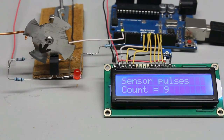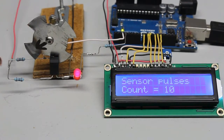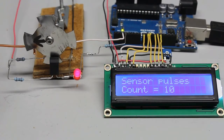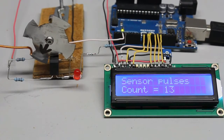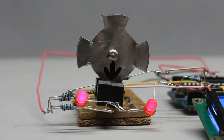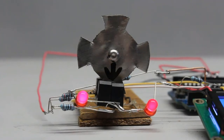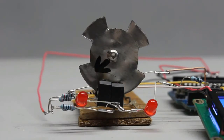The disc has been turned by another 45 degrees if the signal falls back to low. The signal also changes from low to high or high to low when turning the disc counterclockwise. In order to detect the direction of rotation with the microcontroller, a second photosensor is needed, connected to another digital input. Both detectors are arranged side by side. Teeth and gaps of the sensor disc must be wide enough to block or let pass the infrared light of both sensors simultaneously.